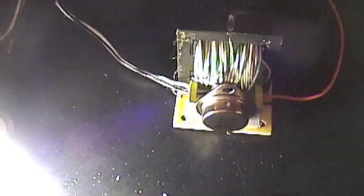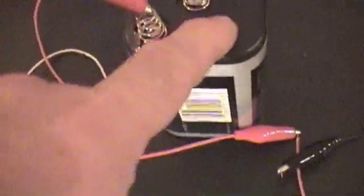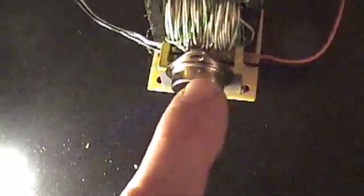I can run it on 6 volts — let me show you that. The battery is a bit run down, about 5 volts. Now we've got ringing. I think the way this works is the bulb is acting as a resistive load, basically dropping the voltage — almost like a resistor and a capacitor. I measured it and I'm only getting 3.5 volts bias. Since the battery is at 5.4 volts, it's barely firing, so we're running at a much slower frequency.